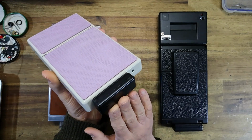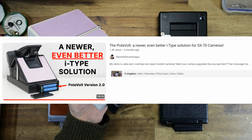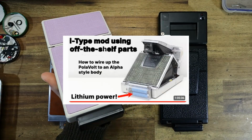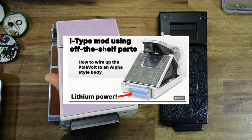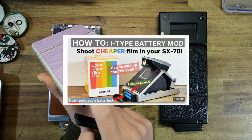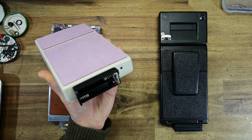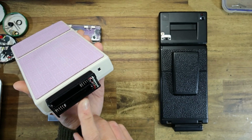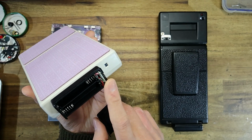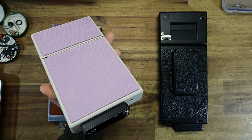My Overhaul system especially, which, in case you haven't seen the videos, I will try and link in the description below and show you guys on the screen what those videos look like, is basically a solution where I add this little AAA lithium-ion battery holder to the back of the camera, which sends approximately 7.4 volts of electricity into this little buck converter chip, which then runs inside the camera in order to power it.